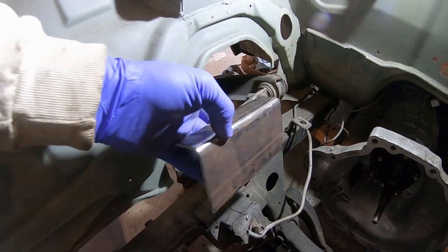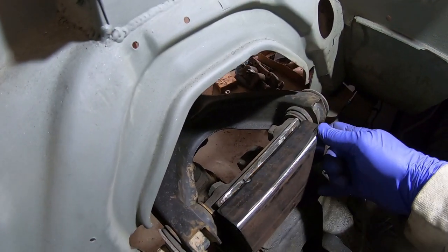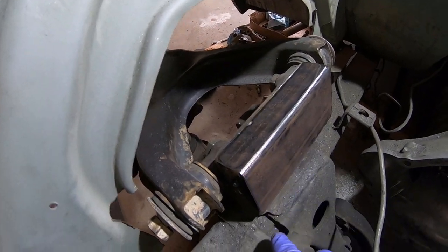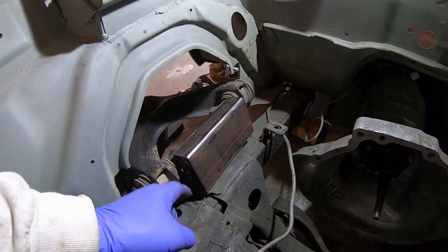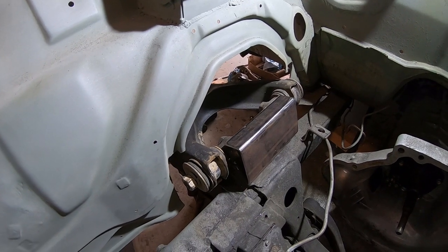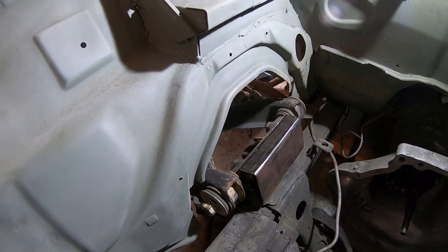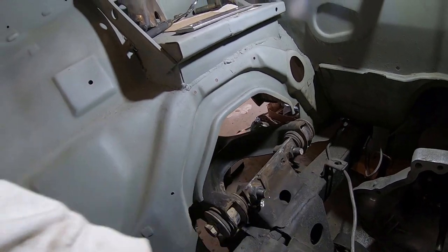I took a piece of steel — I think it was 2x something, not sure of the size — and cut it in half. The plan is to box that in. Ironically, without washers on those bolts it's exactly the right size. It fits nicely on the frame here. Once I get the nuts on and weld it in, I can box it in down on the frame on both sides. That'll look better, be strong, and give me a place to mount a future coilover tower. I just need to weld this up and grind the paint.